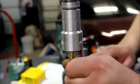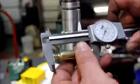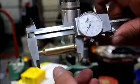About ten thousandths to come off. Give it a little quarter of a turn while it's in there just to keep that squareness. And we're within a half a thou.